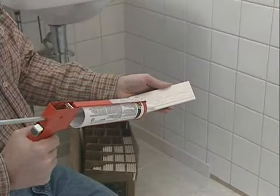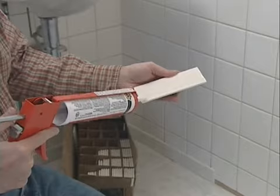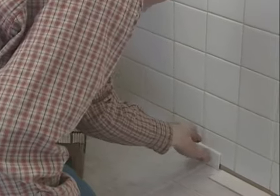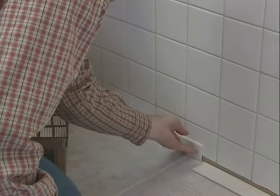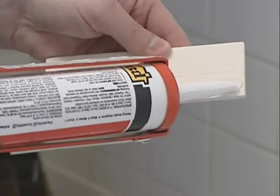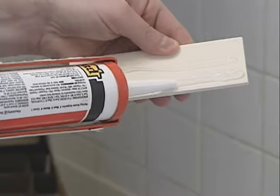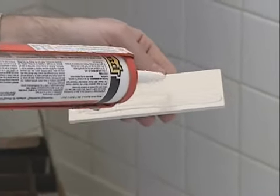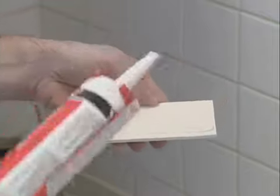In the bathroom, we had a big gap between the bottom of the wall tile where we cut it off and the new floor tile. So we used pieces of 2x6 bullnose wall tile to be sort of tile baseboard. The only way to attach tile to tile is to use silicone adhesive. Once the adhesive cures, we'll come back and put matching wall grout between these new tiles, and we'll run a little caulk into the joint where the wall tile meets the floor tile.